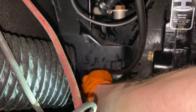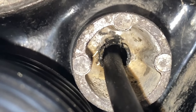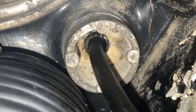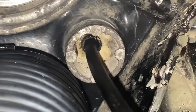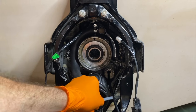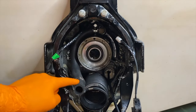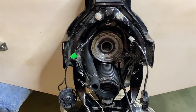I'm routing it around and through cables and wiring the exact same route the old housing was. Right now I feel the tension or weight of the bell housing — I will no longer pull. We are routing the new shift cable housing accordingly. It is now time to install our brand new plastic insert. We'll also need to install the protective sleeve, which unfortunately was not installed on the old one. I wait to install that insert until this point because without the help of the housing guiding that fitting down and into place in the hole, it makes it pretty tough to find the hole. Using the brand new shift cable housing as a guide to shift this plastic insert all the way down and through that hole — push it through until it clicks. Outside the boat: the insert is installed and locked in place. Two quick bits of advice: number one, use the brand new shift cable housing to guide that insert down to the hole; and number two, come to the outside and position the housing accordingly so it's basically centered in that hole and not applying too much pressure to one side. This little protective sleeve that comes in the packaging will go on the actual shift cable housing on the inner portion of the hull — we are not going to install that yet.